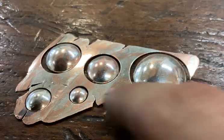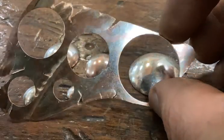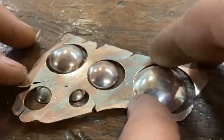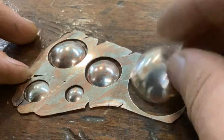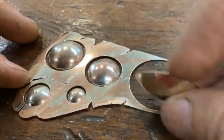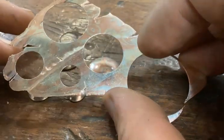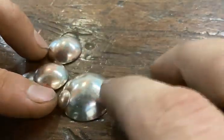So generally it's a good idea to take your trim stock — just a small section — and run it as hard as you can to figure out what it can tolerate. Then take samples from your trim stock, cut them out, and forge them to your pre-shape. That will give you a sense of what your billet can survive in terms of process. This is rolled down to about 20 gauge and then to the point where it fractured, to see what work hardening would look like. Then samples were made from all those component parts.